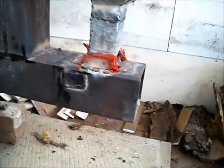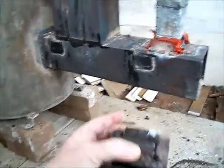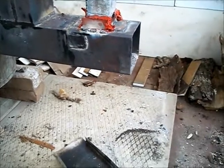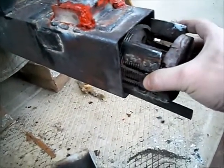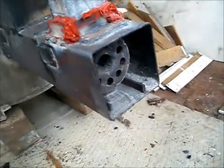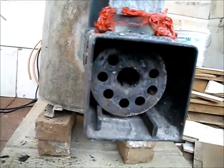But right now, just as it is, I get about 350 degrees on top of my stove. I saw a video of somebody creating a pellet burner not too long ago — just this pellet burner inside about the same chamber, 4x4. The pellet burner slides in just like that. When I burn it like this, I'll never reach over 350 degrees on top of the stove.